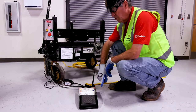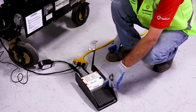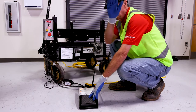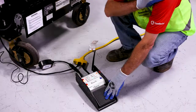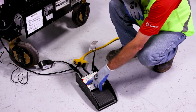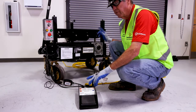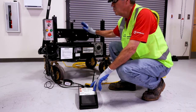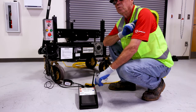Right now, just for illustration purposes, I'm going to go to standalone mode. When I step on my foot pedals, the feeder runs regardless of what the person on the puller is doing — you can see it running and hear it. When I take this off standalone mode, now both the person on the feeder and the person on the puller have to be on their foot pedals, and the feeder runs automatically. If either person steps off, the feeder stops in conjunction with the puller.